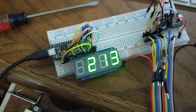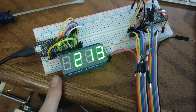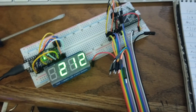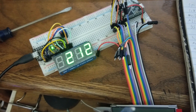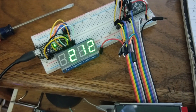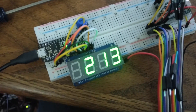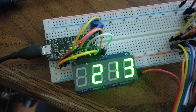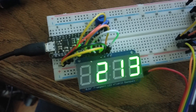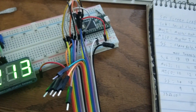So: AC control, temperature-adjusted control, and display output. The temperature I'm going to be reading from is the thermostat housing sensor, which is only on 97-01 Jeeps. Since I had replaced my thermostat housing, that was the only one I had laying around, so we're going to make use of that sensor. For the screen, this is just a 7-segment display. It is I2C, so we just have positive and negative for power, and we have our data and clock pins - that's it. The Adafruit library takes care of the rest.